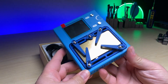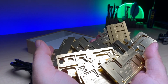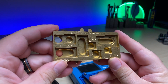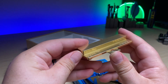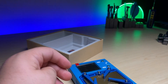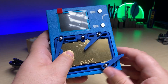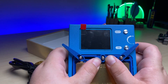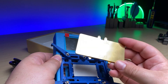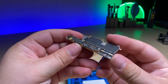Out of the box we've got a nice small design with power cable and a bunch of different plates for all of the different models that it can do. Also the rear cameras, and here is a unique plate that can be very useful for some repairs like proximity sensors and other things when trying to save Face ID. It's got these nice little arms that you can change positions with the slider here, which is super convenient. We can also pop out the other plate, which is convenient for just preheating things without necessarily needing anything but a flat surface.